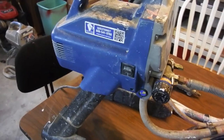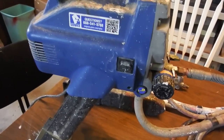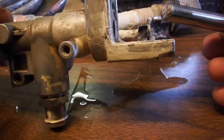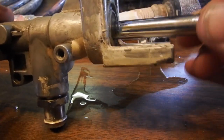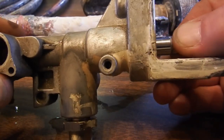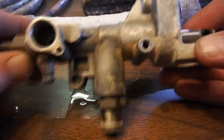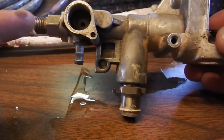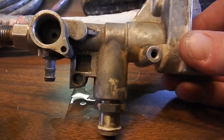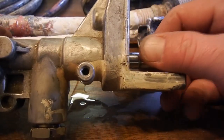Airless paint sprayers use an electric motor to spin a shaft that in turn runs a yoke or a bearing that pushes a piston. This is how the pump sits in your sprayer. This is the piston — it slides into the cylinder, hits the seal right about there, and this is about where it rides. On the backstroke, since paint can't come back in this way, it pulls from here — a little ball goes up and in — and then when it pushes forward, since it can't go back out, it has to go into the hose. So it draws fluid up when the piston goes back and pushes paint into the hose when it moves forward.